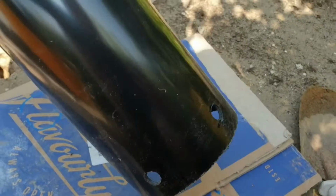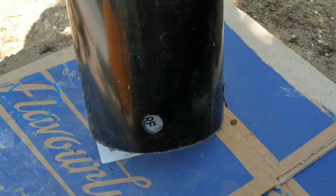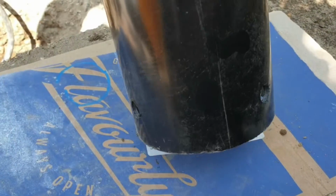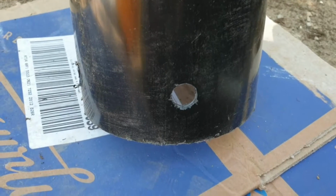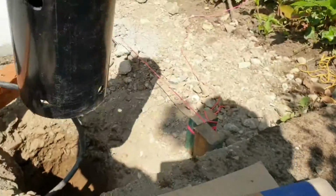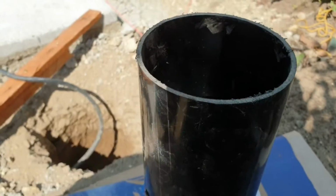Okay, so this is my ducting, nice and clean. They're about a foot deep, each of these, there or thereabouts, depending on how low I've got on the hole. So I've got my entry hole for the cable, which is actually 16mm, funny enough, not 12mm like I said earlier. And then at the bottom where it's going to drop into the sand, I've just drilled some 12mm holes. So as that sits on that bed of sand, if water does get into the top of this for any reason, it's going to get down to the bottom. It's going to meet the sharp sand and the shingle, and it's going to just drain away quite nicely. So nice and easy. Drop that in there, pop my sand in, cut my cable, leave it hang out the top, put the tile on, add some sealant.